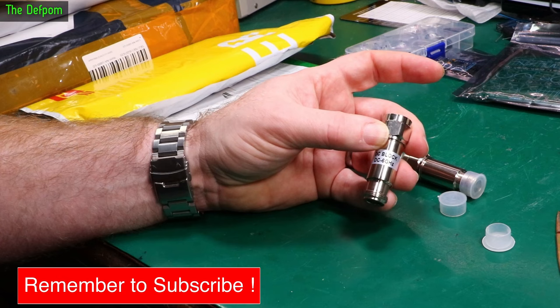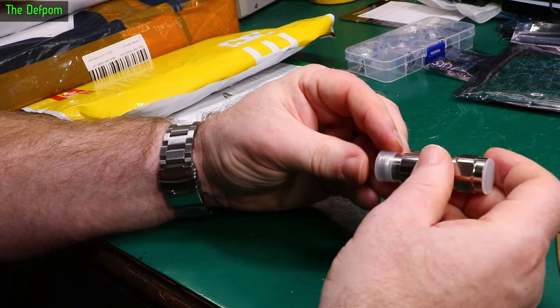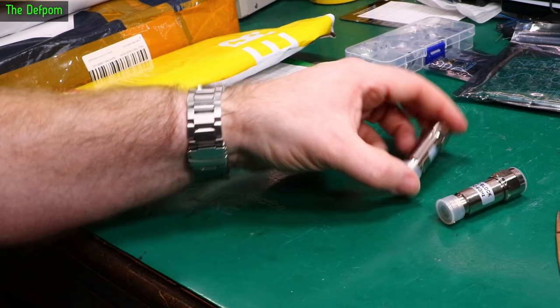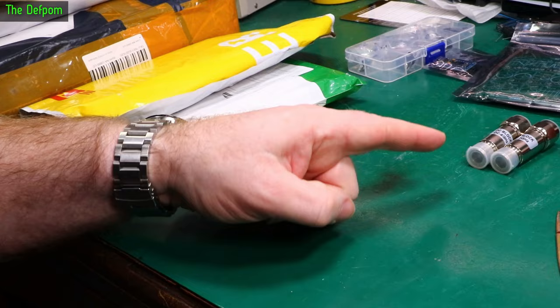So it's always a good idea to make sure you use a DC block. I picked up a couple of these because I need them on different devices. One is my new spectrum analyzer, which does actually have a 50 volt tolerant input according to the front panel, but I'm going to put these on anyway. And the other one is my CMU 200, which does have a DC block on it right now but it's a BNC type. I wanted to put an N type on there because that's what the connectors are on the front. Can never be too safe — always use protection.